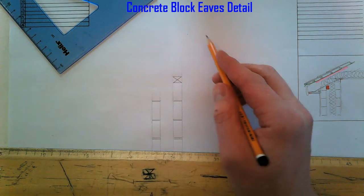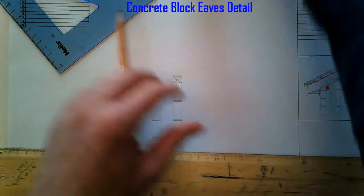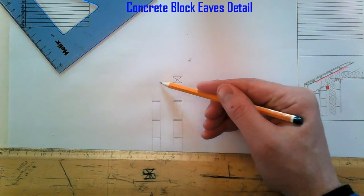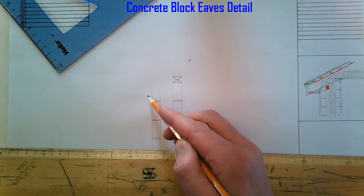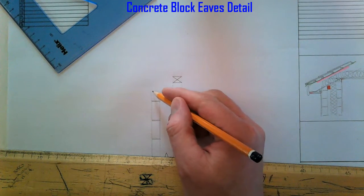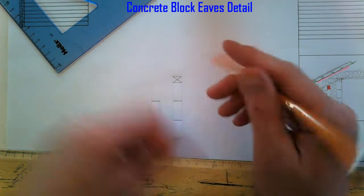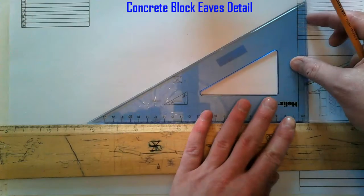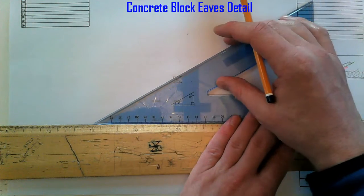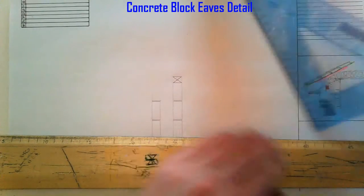The reason I didn't come up another block on this leaf is: when we put on our rafter — we're going with a 30-degree pitch here — out on site in reality, if you have a full block here your rafter is going to hit it. So you'll end up either knocking off the block or taking a notch out of your rafter. Good practice when putting in the rafter: from the edge of my wall plate, that's my bird's mouth — just a nice construction line there at 30 degrees.